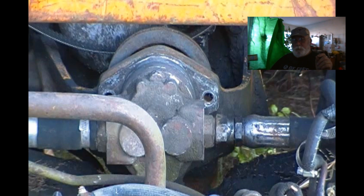There's a black hose on the left held in place with two hose clamps, and that hose is the only thing that caused any difficulty whatsoever. Whoever had put this on previously — and this wasn't from the factory; this thing is 40 years old or older, maybe 50 — that black hose on the left should only be three inches long and it's four and a half inches long. If it was three inches long, we could just slide it to the left, loosen up some hose clamps on the bottom of that big metal pipe you see curled right in front of the hydraulic pump, and that would allow it to swing forward. But that black hose caused more trouble than anything else.